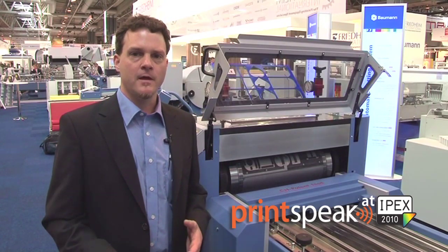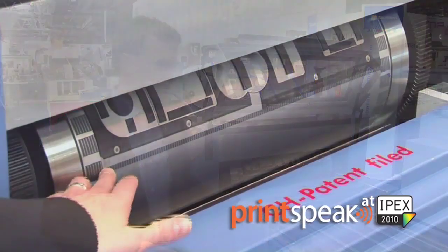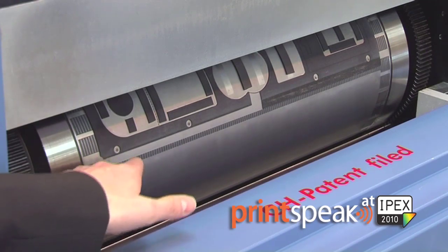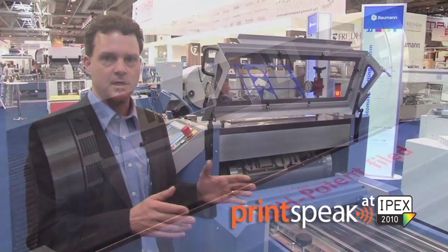We are using two magnetic cylinders, a top one and a bottom one. We are also using flexible dies as you can get them everywhere in the world. They are stuck on the cylinder and with four alignment pins we are able to set the flexible die correctly to the cylinder. The lower one is used when we have a matrix and patrix for embossing or scoring.